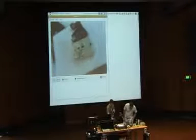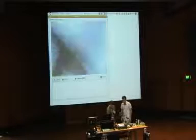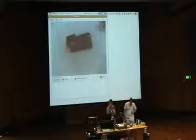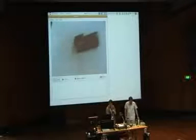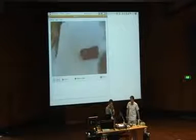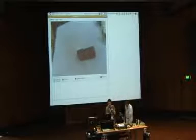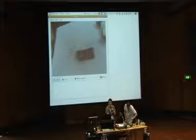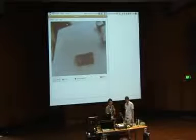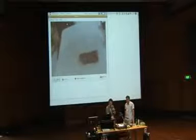The other board I wanted to point out is this little red board, which takes quite a different approach. This uses a part made by a Korean company called WizNet, and they do the entire TCP/IP stack within the chip. What you're presented with from a programming standpoint is a set of socket interfaces. So you have in a sense a command channel, over which you set your MAC address and your TCP/IP address for the host, broadcast, and some of those basic parameters.